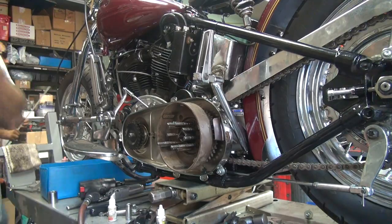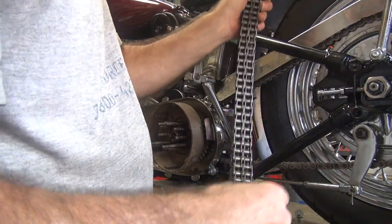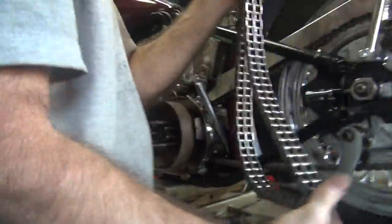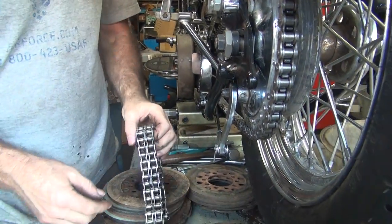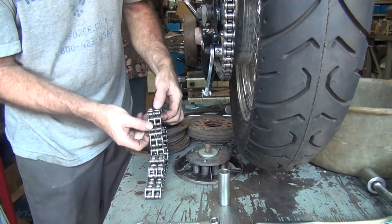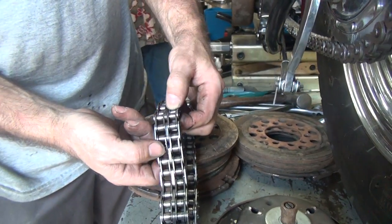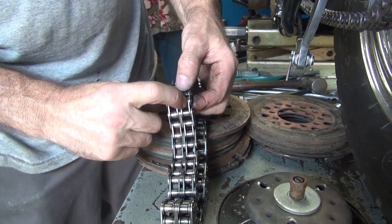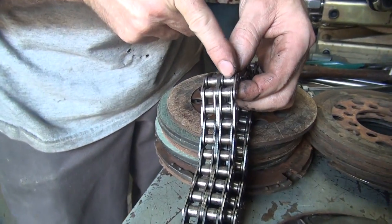What have we got for a chain? This is Dan's favorite chain — it's almost no clearance in it, so that should be good. You can't videotape it the way I'm over here. So the chain is nice and tight, which means it's only half worn out or three-quarter. We look at all the rollers and make sure they're not broken. They've got split rollers and solid rollers. Now this is a solid roller chain, and that roller is a split. So that means that roller I was looking at that was split right there is a bad roller. This chain is on its way to being broken.